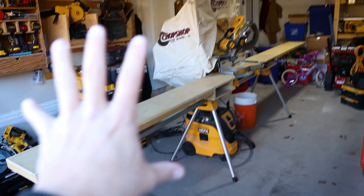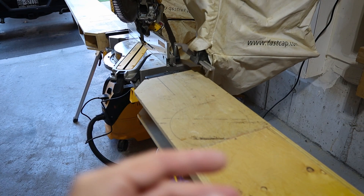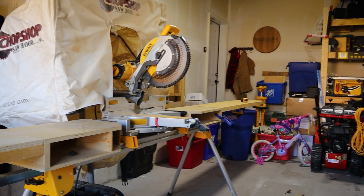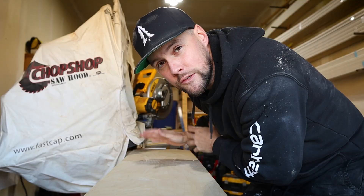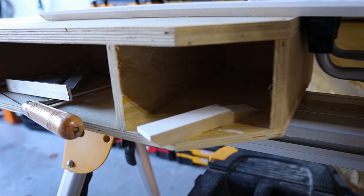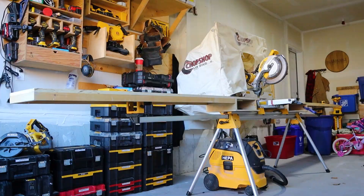So this right here is my current setup for doing trim work — these are my miter saw wings. I don't know why a brand has not come up with their own version of this. I built everything out of scrap pieces, but I think it is vital to make yourself a set of wings. I do have plans for this current design and I will link those in the description below. My wings are set up in two stages: the actual arms and the base. The additional work surface off the sides of your saw is vital, and the shelf really helps store little tools like files, drills, or jigsaws to keep everything in close proximity and reduce your steps.